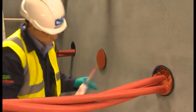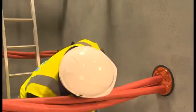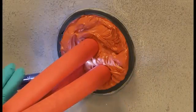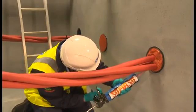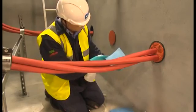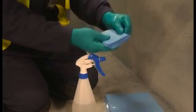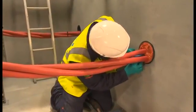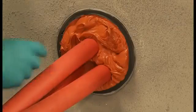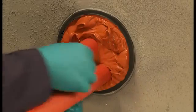For a duct of this size, two cartridges of sealant are required. Using a torch, check for gaps in the sealant and apply more sealant into any gaps if needed. Using the water spray, dampen the cellulose sponge — this is done to stop the sealant from sticking to the sponge whilst working with it. Using a dabbing motion, firmly pat down the Noferno sealant, ensuring it makes good contact with both cable and the duct wall.